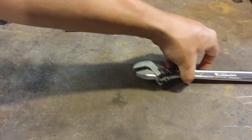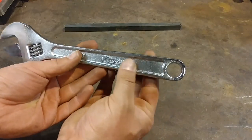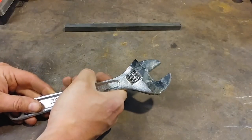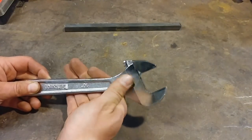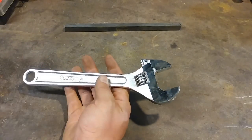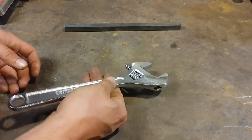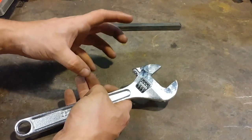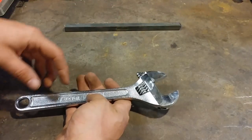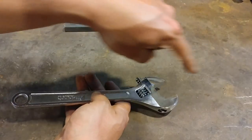Generally for a twisting wrench you need a wrench of some sort. I find these really cheap generic wrenches from Harbor Freight to be the best for twisting wrenches, and they're adjustable to quite a large size stock. If you need to twist large heavy sections of bar stock, this may not be your thing — you may want to go with an old F plumber's wrench, or make your own specifically set wrench.